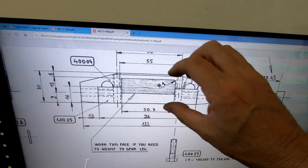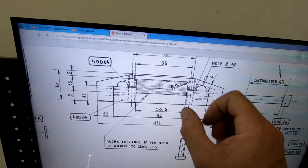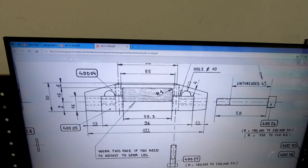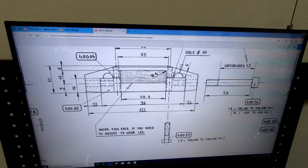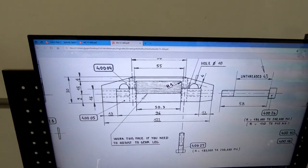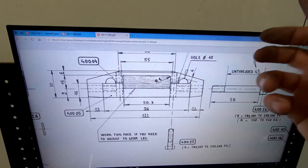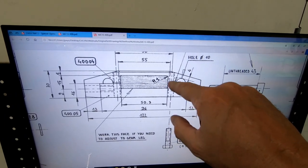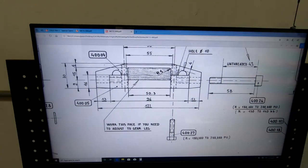Instead of just assuming that it's a tight fit against the gear, we can actually provide some additional torque and tension on the gear to clamp it. And that's probably critical if you're using the fiberglass gear, which is going to be a little bit softer. It's a little less of an issue when you're using the aluminum gear, which is very stiff and solid and hard. You could actually mill this out to fit exactly and clamp down on it tightly without requiring the gap there. But I'm going to go ahead and do this opening here and go ahead and do the gap in there also, and just make these exactly like they're recommended to be made here.